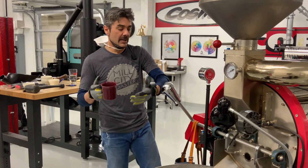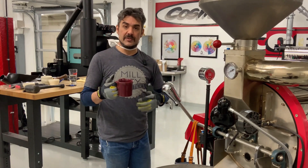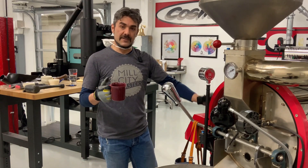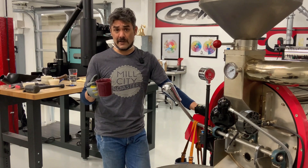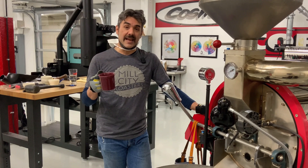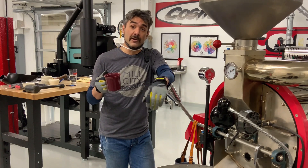When I came in this morning, I have a pretty big roast order for this week, so I came and walked around the roaster, made sure everything was good, emptied my chaff can — it was all straight — but then when I looked under my burner I noticed there was a very large pile of chaff, some of which had started on fire during my previous roast day, and there were chips of beans and some small beans that had fallen through the gap and gotten into the burner tray.